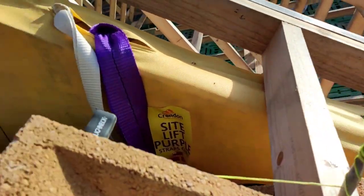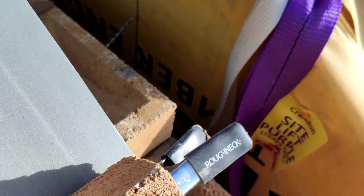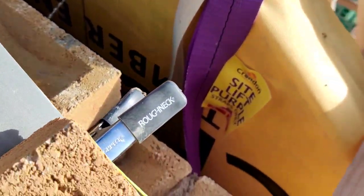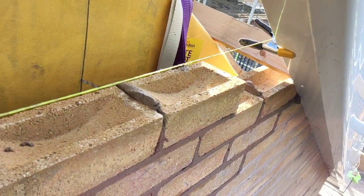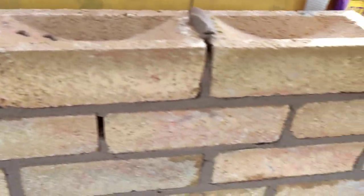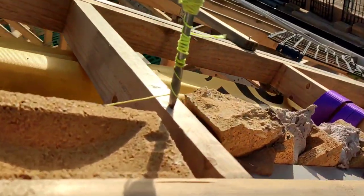I normally just bed a brick on each side with a nice joint and then move the lines up to that brick. You can't get right to the end of each course with them, so you've got to leave a brick back and then move up and just fill in freehand, but it's no sweat. You get into a good rhythm, no corner building, and it's quite easy.